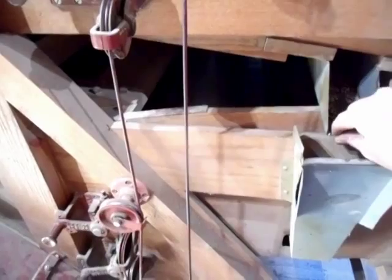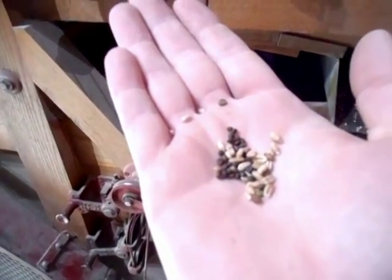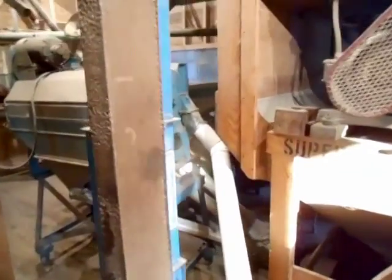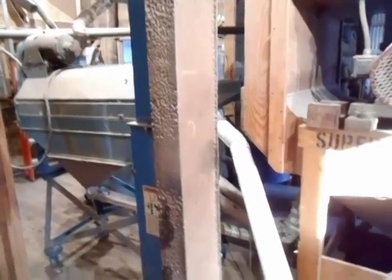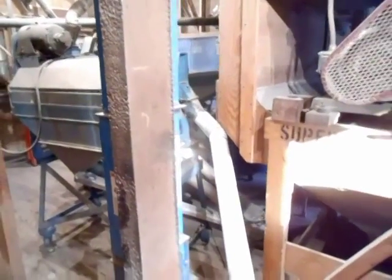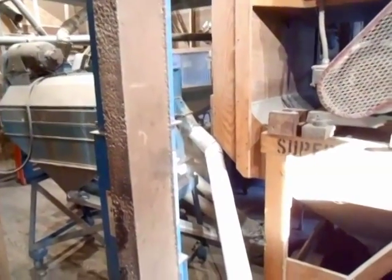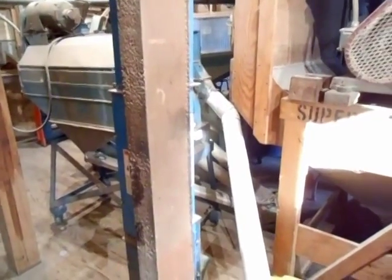Now what the 664 slotted is doing is dropping small shriveled vetch and small kernels of wheat. So we're going through the cleaner, the set of screens that I just talked about, through the spiral, and the vetch then is pretty well perfectly clean. It might be a kernel of vetch. From the spiral we could actually probably go right to the bagger, but I always run it through the velvet roll machine to catch any impurities that the velvet rolls might kick out.